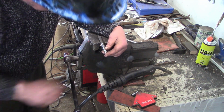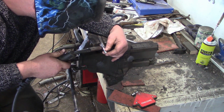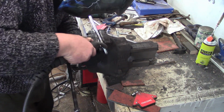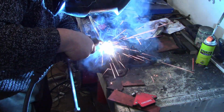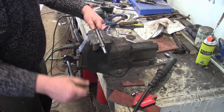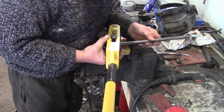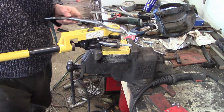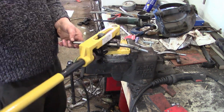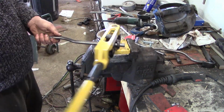Okay, onto some tie rods. What we need to connect the steering box to the wheels. Yeah, tie rods, track rods. I don't know. I'm not a motor vehicle mechanic. Just a bit of 20mm pipe with some 10mm thread poking out one end, and I've got to bend them to clearance everything on the frame of the truck. It's basically a dog leg and then a little kink at the other end. I've already done one, so I'm just using that as a template to do the other.